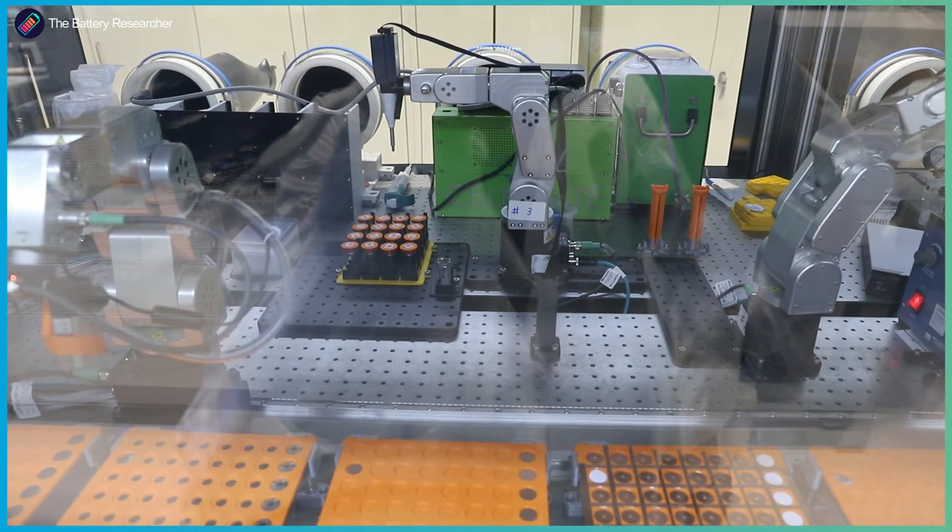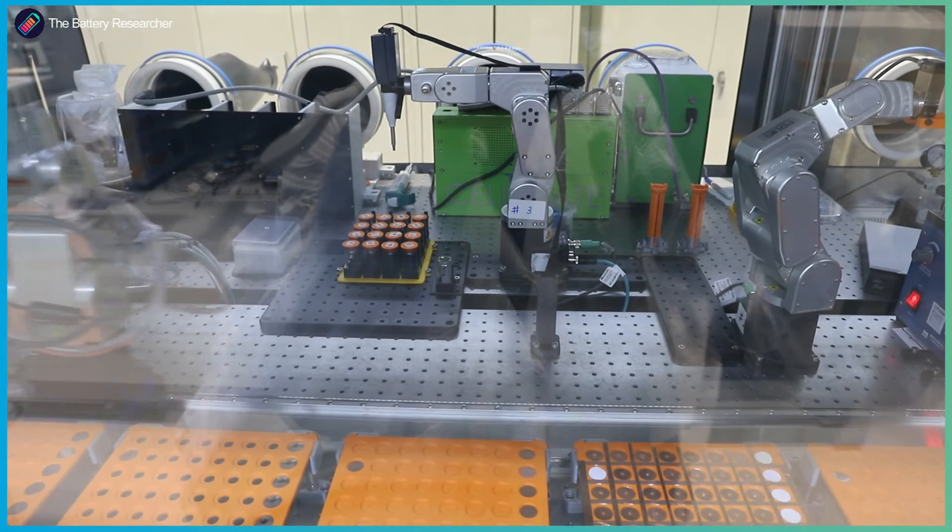Going down to three minutes in academic production for a full coin cell opens up entirely new avenues for research. Other authors have reported that you need a minimum of eight cells to really study cell-to-cell variation, since all cells have some variation. Now that we are able to manufacture almost a few hundred cells in a single day — it's expensive, but we can do it — we can find very minute differences between cells, or change how we process cells during formation, charging, or when running special chemistries or discharge profiles.